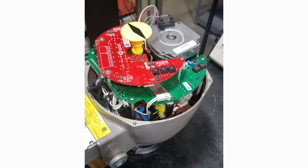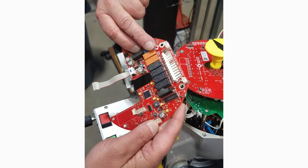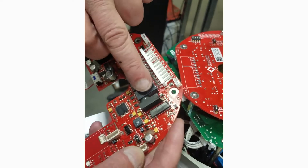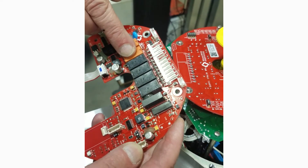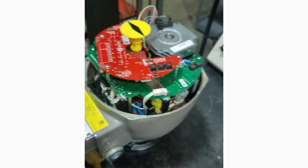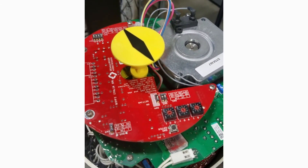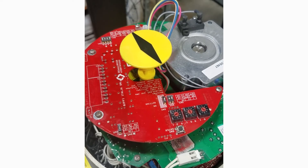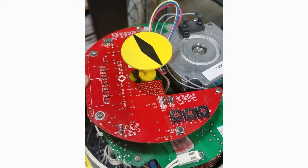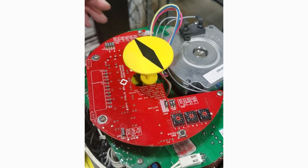We can add to the basic open and close actuator an analog card. The analog card has an analog input, a feedback, and a number of relays — two for monitoring the position and some additional status position relays. This particular card is set up for 4 to 20 milliamp analog current input and output. We can additionally set the unit for 0 to 10 volts DC input and output, and we can mix and match the 4 to 20 and 0 to 10 signals.